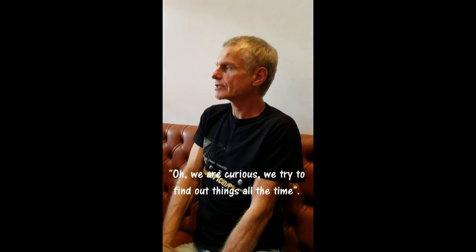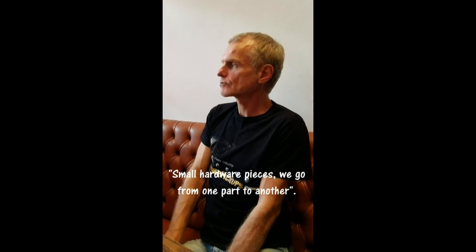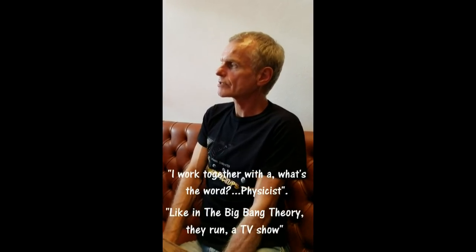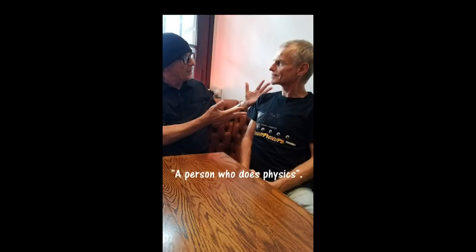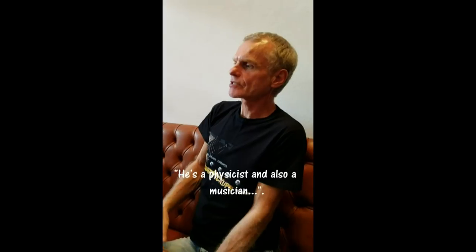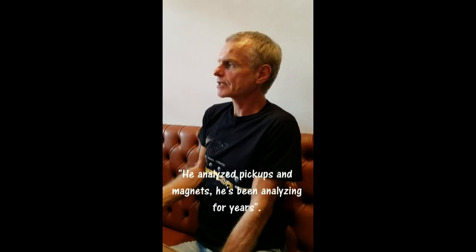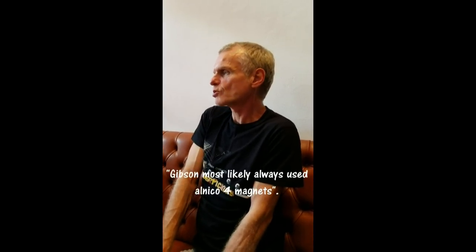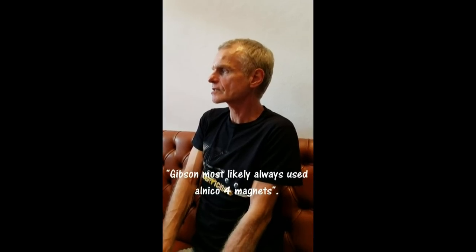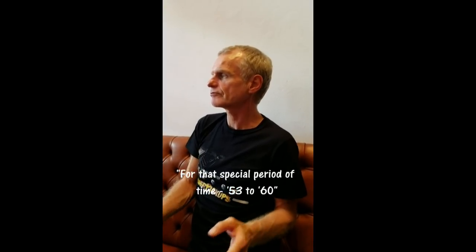Oh, we are curious. We try to find out things all the time, small puzzle pieces, one comes to another. And I work together with a physicist, like in the Big Bang Theory, the TV show, a person that does physics. And he's also a musician, a good guitar player. He analyzed pickups and magnets, has been analyzing for years. When I came in, I brought in all the experience I had, and we put that together and found out that Gibson most likely always used Alnico 4 magnets for that special period of time, 53 to 60.